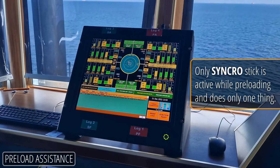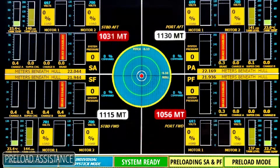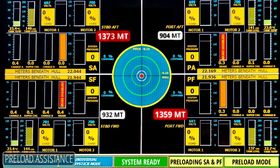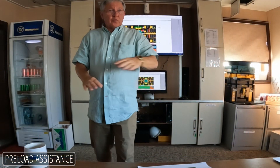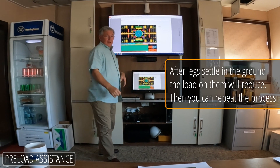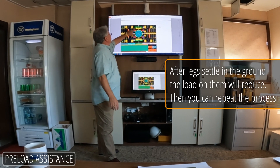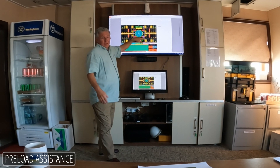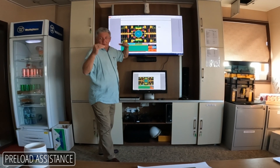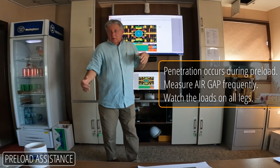So when that happens, these legs start coming up, brakes release, and these values begin to climb. The first leg to reach the set value stops the whole thing because of the diagonal. Sometimes I'll do it again just to give it a happy reset — it resets after about seven seconds. Then you wait. At this point, this leg might be at 18, this one at 17 or whatever, and they start to come down as the legs begin to penetrate. These values may go way down to maybe 100 or 200, and then start to come up.